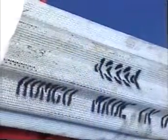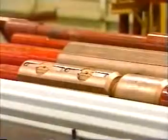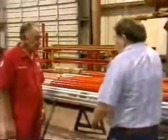The standard Homco steel liner patch has a 1/8 inch steel wall thickness, leaving a total casing ID reduction of 3/8 of an inch. In special situations where higher pressure is a concern, a heavier 3/16 inch patch is available. Homco also supplies lead-wrapped patches for high-temperature situations.